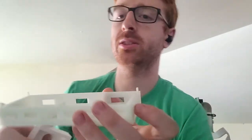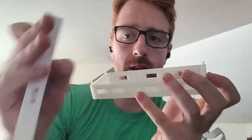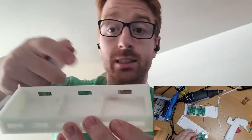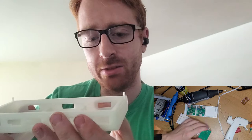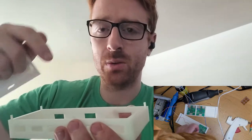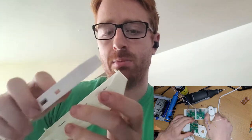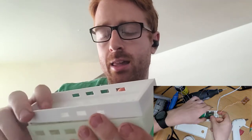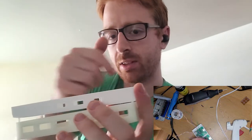When it came to actually assembling this, it was pretty interesting because I have three slots on the bottom and then a hole here. I had to wire them in, put them in, and I just glued them in because the screw holes didn't fit enough. I put them in with the wires, fed the wires out through here, put this on top, got the lid, and put the button in, then soldered all this stuff together.